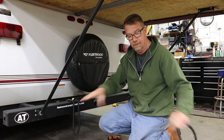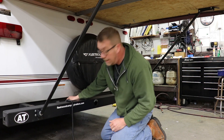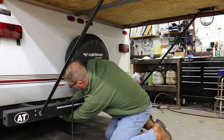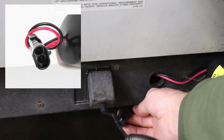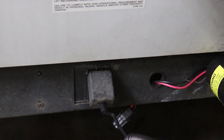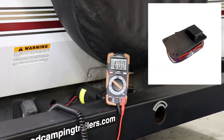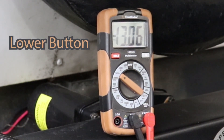Got the remote. Finding the power leads coming right out of the top of the motor head, we can unplug this unit right behind here. Here's the connection we unplugged — this harness goes right into the motor head for the power lift motor. This is the connection you want to unplug as well if you ever have to override the lift system. Plugging my multimeter into the harness out of the current limiter and hitting the remote — good readings both directions.